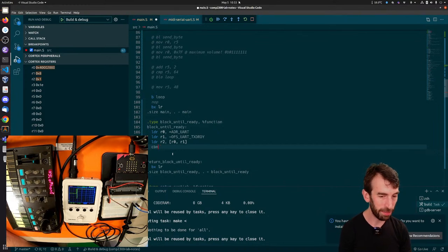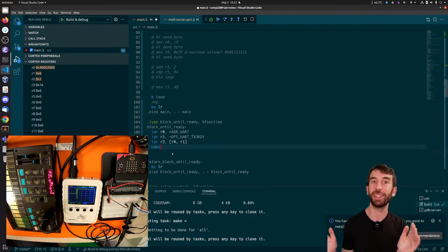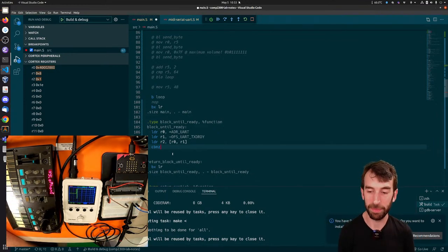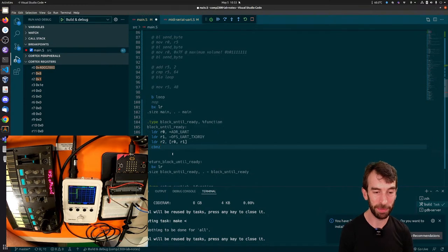Someone's saying if there's another micro:bit receiving data, you'd have to use the RX stuff. And the RXD has, I think, 8 bytes in a cache. So you don't have to read them all at once. You can wait a little while for all 8 to be ready and then read them as a group.